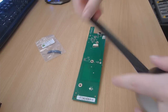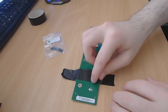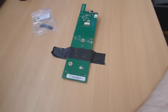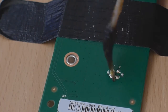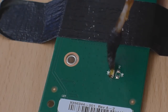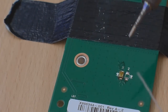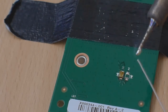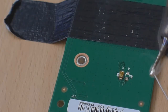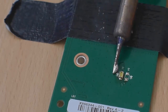What I'm going to do is get some tape and slap that down to hold the board in place. I don't have a clamp — that would be the ideal solution — so I'm just going to use some tape. Then I'm going to apply some flux to the LED to hopefully make it a little bit easier to take off. I'm going to apply some solder to the iron — you want to apply a decent amount, get a nice blob going on the iron itself — and then apply that to the side of the LED.